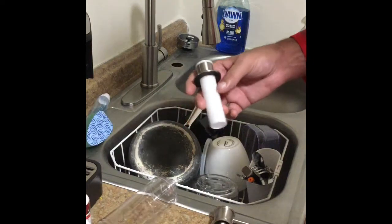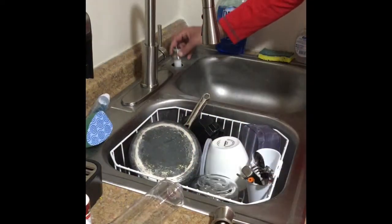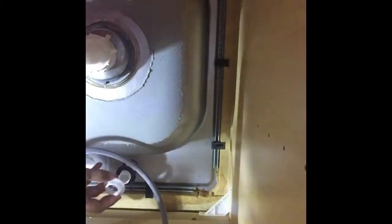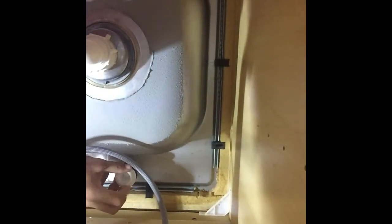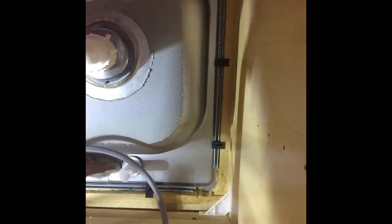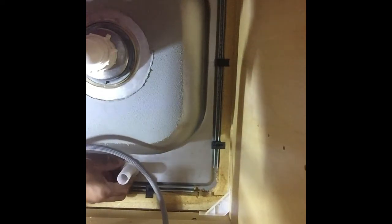This here is going into the hole — that's the tube that mounts the pump and also what the bottle screws into. Underneath, we take our other washer and our plastic nut. Here you kind of need a second pair of hands to hold it in place as you tighten up from underneath. Take your washer, then take the little plastic nut and get that threaded on there. Remember to start off nice and slow — sometimes it goes backwards until you get the threads to click, to make sure you don't accidentally cross-thread it. Tighten it by hand; it should be more than tight enough as long as the person up top is holding it, and it should keep it from moving while you're using it.